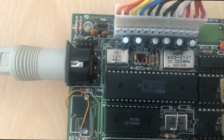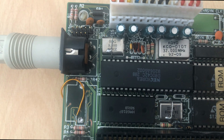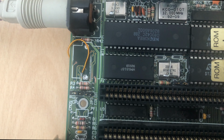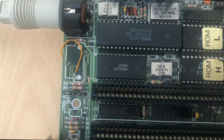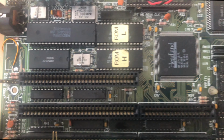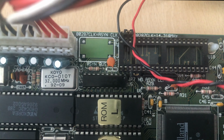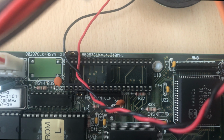One thing also to notice, there is an external battery connector there, so you could install an external battery to keep the settings for BIOS, but this battery should be 6 volt, not 3.6. I found that in the schematics. Probably also something we've got from the original 5170 that had a 6 volt battery with, I'm not sure it's completely that style of header, but basically that style of header. But I went the other way, I will show you that shortly.